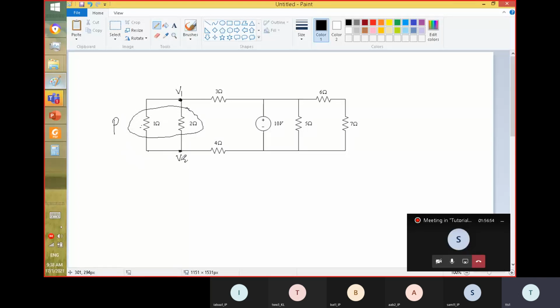Okay, these are messy because all the voltages are different, so we won't look at this one as parallel or series. But we can look here. Let's say this is V3. After the resistor, we have another node voltage called V4. After the next resistor, we have another voltage called V5. So you can see these 2 elements have 3 node voltages. That means these two are in series, because 2 elements, 3 voltages.